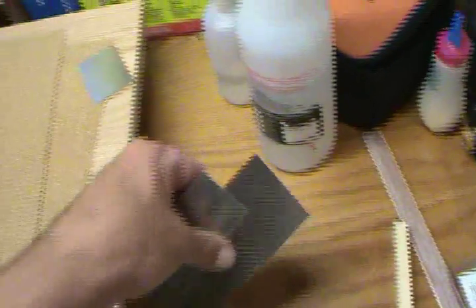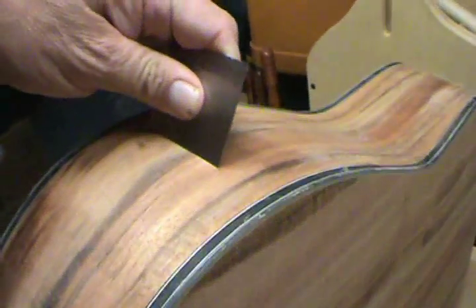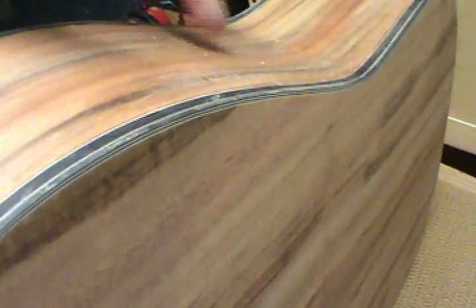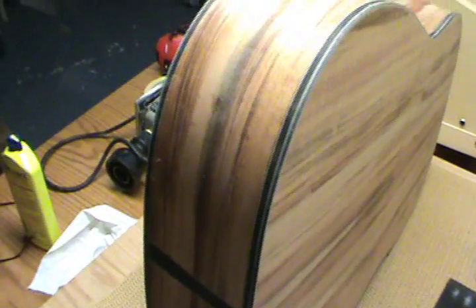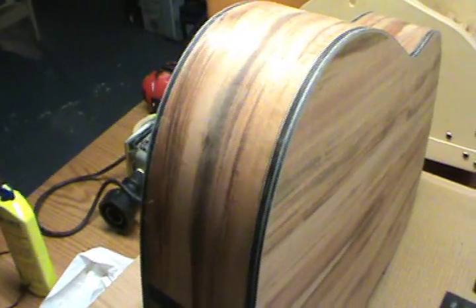I've got 3 different size scrapers here, and I've been practicing how to sharpen them. I got this little burnishing tool, and it seems to work pretty good. I'm starting to get the hang of it, trying to get the burr on there. But I've got them where they're getting more curls than they are sawdust, so they seem to be pretty good. So I gotta imagine there's going to be quite a few nights down here just doing nothing but scraping. So it could be another week or 2 before I get the next video up.